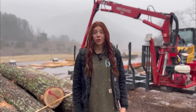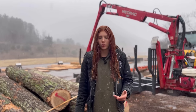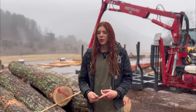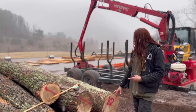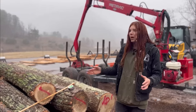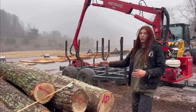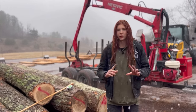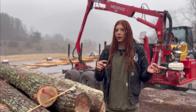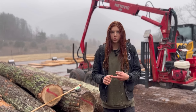One thing I wanted to mention: because this is all hardwood, it's also graded. First up we have veneer, which is the highest quality log. Next is prime — actually this log right here that we just scaled. To make prime, it's clear except for one side: a little bit of knots on one side but the rest all clear, so it's technically prime but not perfect, so it's not veneer. Below prime we have select, and then below select there are ones and twos, which are the lowest quality logs.